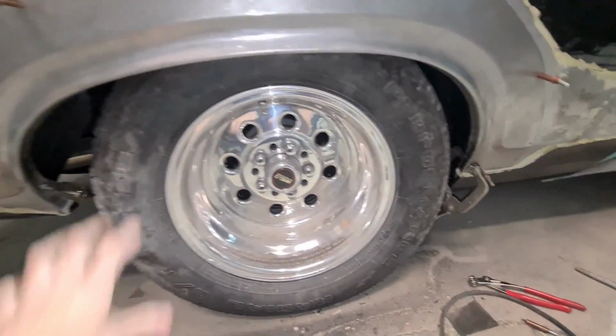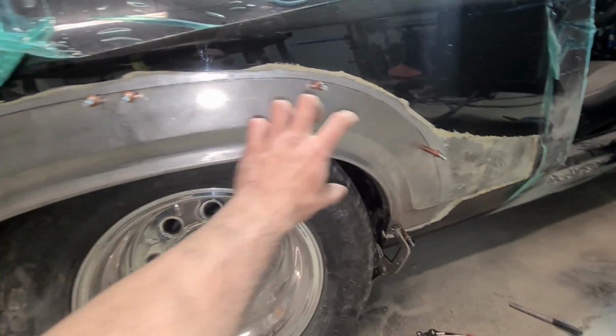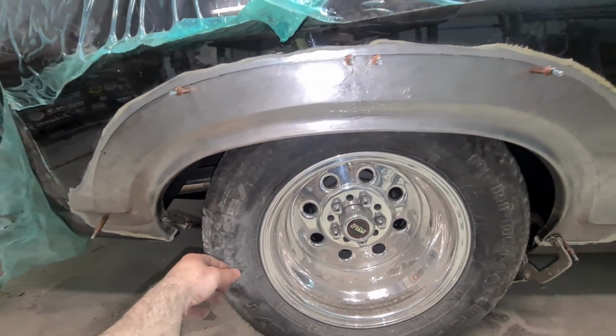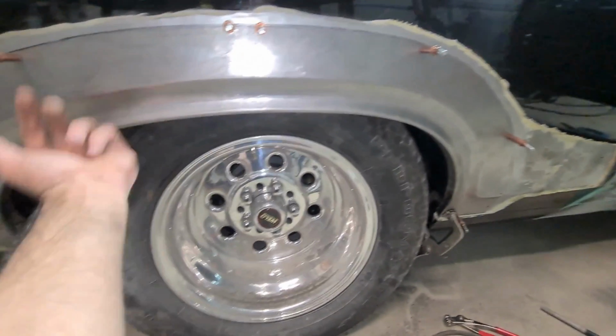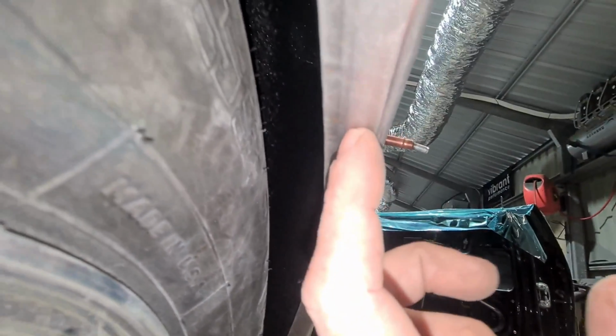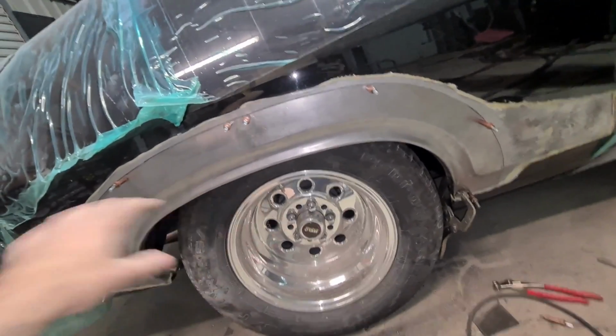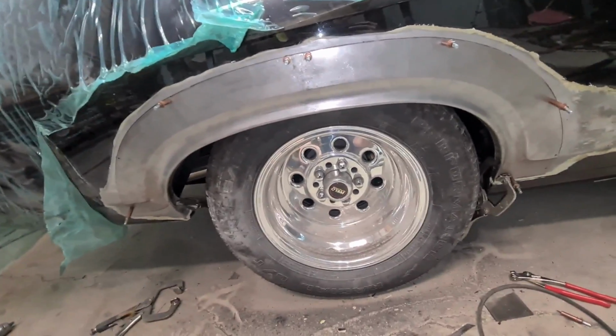So now I'm going to take the wheels off, just put it on jack stand, and I'm going to make the inner arch that it needs. Really hard to see in there, but the inner arch has been cut here off the existing outer wheel well, and I've got to bring that down to meet. So I've got to extend the inner arch 30mm. So yeah, I'm going to take the wheel off, make that piece now, get it tacked in, check it on the arch again, and then they've obviously trimmed this edge back right down for wheel clearance, so I've got to match that to the other side. And yeah, pretty much want all the inner arch welded in and sorted, then I can prime it all, and then I can put this outer on.